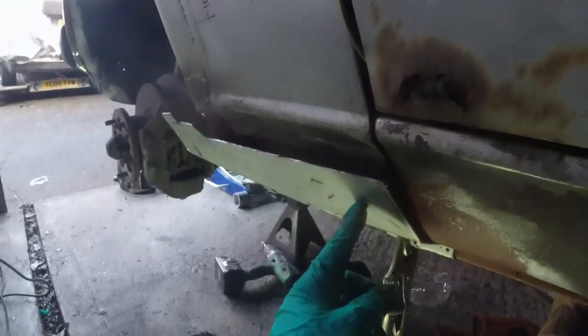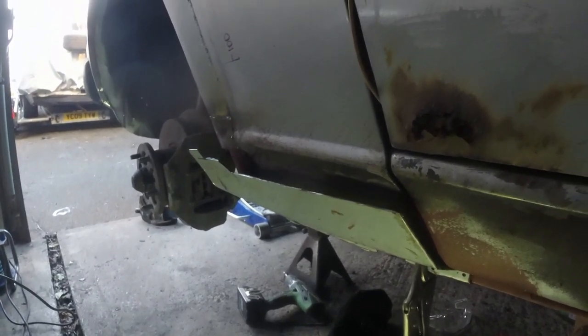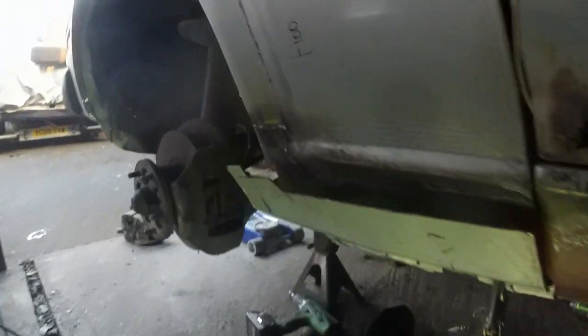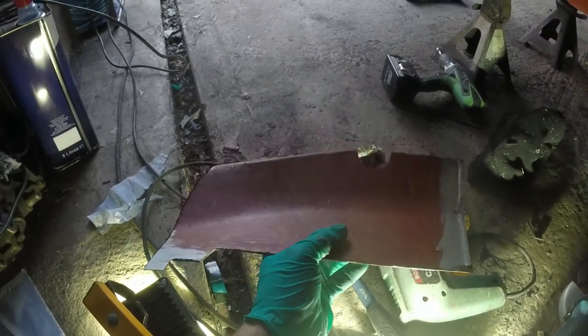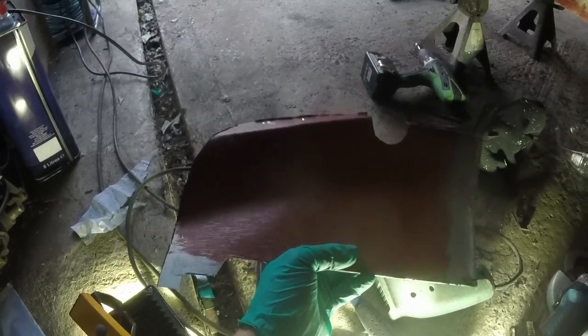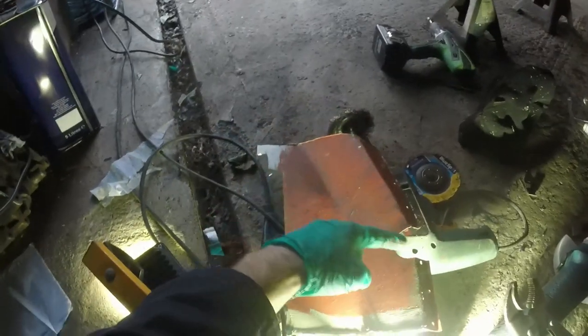I'm never going to be able to get to the back side of this again, and what I tend to do, particularly with parts of the car that are very low to the ground, is drop it on the floor like that and then get some waterproof top coat, just a black can of spray paint, and tosh a load of it on there. Some of it will burn out and that's fine, but it'll be up here where I'm seam welding it. That bit gets tapped around and plug welded, that bit gets plug welded, and all of that I can absolutely douse in cavity wax through that hole.